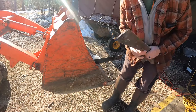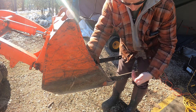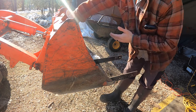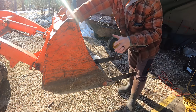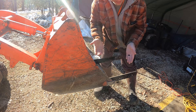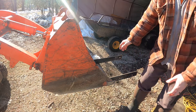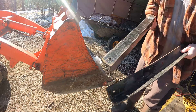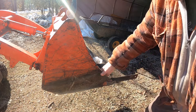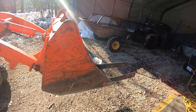Like I said, I saw this last night. We have this quarter-inch angle bracket — what I want to do is bolt these to the forks and put a little miter on them. We just need something to get underneath the log and lift it up. We don't have money for a grapple — that would be sweet. I do have bucket forks but bucket forks suck; if you've ever used them they get twisted, they're gnarly. I need a shallow finger that sticks out to get under the log and flip it up and hold it against the bucket. These two pieces are exactly the same, got them from the scrap bin — they already have some holes pre-drilled.